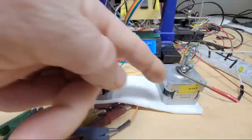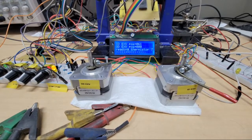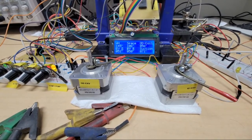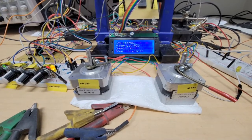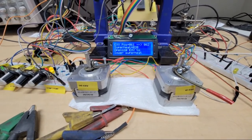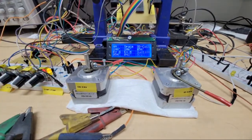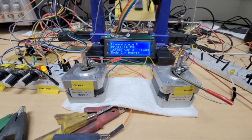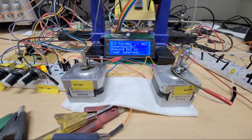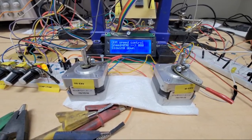So it's still opening the expansion valve because it's trying to adjust the superheat. And it should start slowing down that blasted fan if I cooled off that outdoor coil enough. Yeah, slowing down outdoor fan. Opening expansion valve some more, slowing down the fan some more.